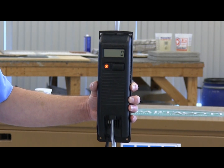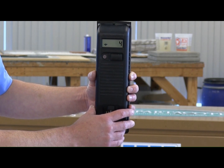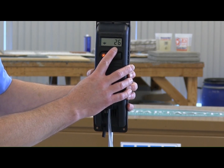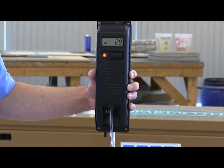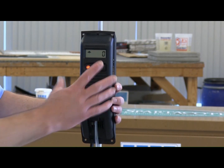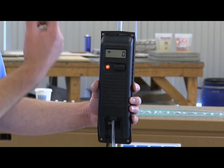Avoid shaking the hose or allowing the hose to sway when measuring. Hose movement will cause the readings to fluctuate until everything is still. Move the handheld unit to a new location. The vertical distance to the reference point is displayed in millimeters or inches. The direction to the reference zero point is indicated by the arrow. When you are measuring a point below the zero reference, the arrow points upwards and the light flashes slow.